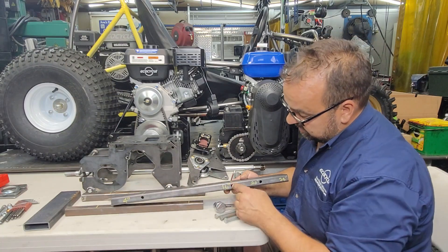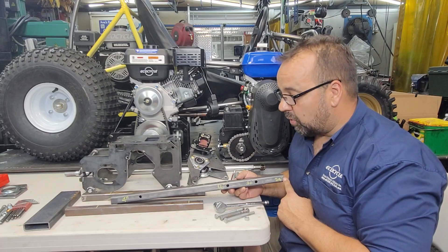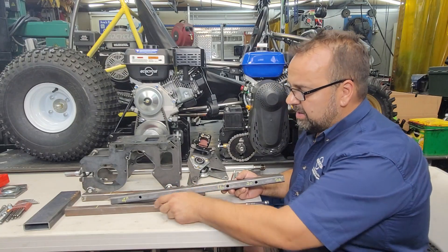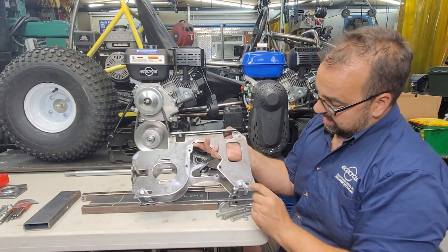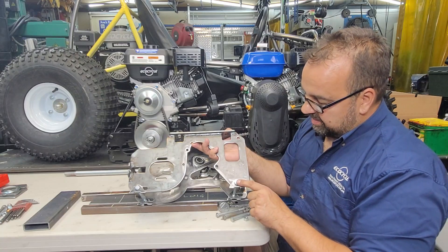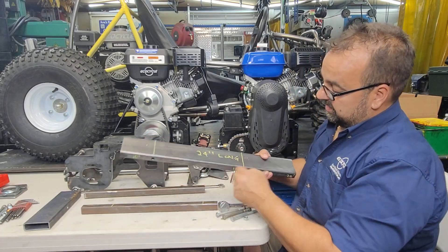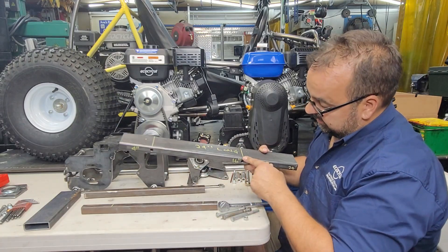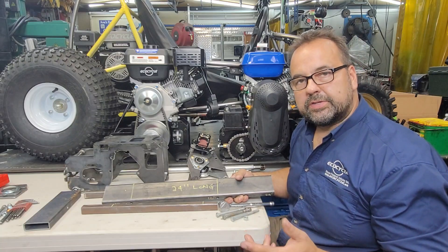This is the front of the tube. Measure four inches, measure 16 inches, and measure 20 inches — your piece is 24 inches in total. For cross-bolting, you're going to need holes at the four-inch and 16-inch positions. Now I'm going to show you a tab mount using 1x1s. You can see that the power pack has a couple of weld tabs that are just bolted onto the slots, and you put these on 12-inch centers. Even if you don't drill the four and 16-inch holes on your 1x3, you should mark them all out so you know where four and 16 inches is from the end.